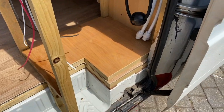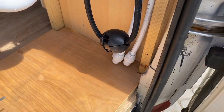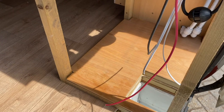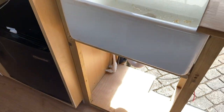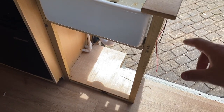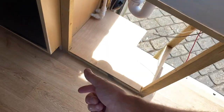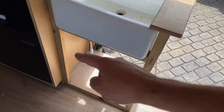That's the basin cut down and varnished. I just need to cut the hole for the waste to come through, but I'll do that from the bottom of the van once it's screwed in place. Now I want to start on the front of the unit - I'm going to cut down some strips of pine to go down each side, either side of the sink, then one through the middle and one across the bottom, and then we can make the door to fit inside that frame.